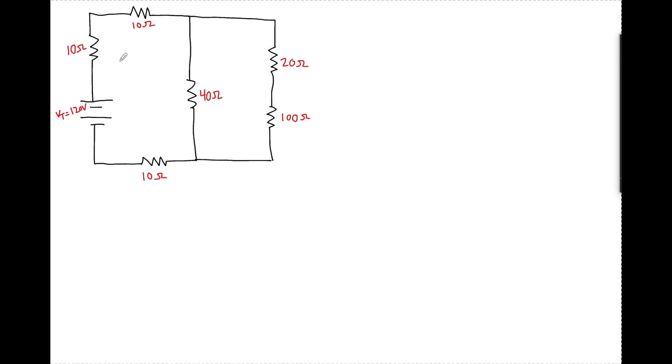To find V equals IR, I'm going to take what is a combined circuit — by combined I mean I have some series things going on and some parallel relationships going on — and I want to get to an end goal where I just have one battery and one resistor. Then I'm going to work backwards, expanding things, crunching all of these together to make one resistor.